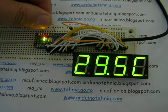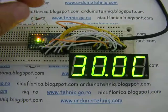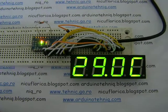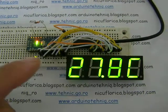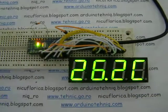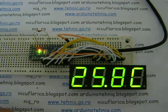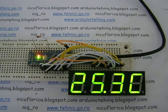Temperature is measured not every second, because in air like this the temperature can oscillate and is not stable. But this format is very simple — you just need an Arduino, a diode, a few wires, and USB power. The display is a four-digit seven-segment type. It can be common anode or common cathode — just change a few lines in the sketch.